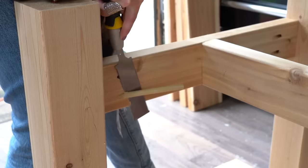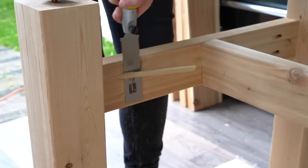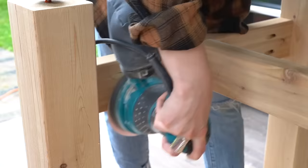Once those bumpers were installed, it was then time to close up all of those pocket hole openings. We decided to go a little fancy here and use some wood dowels and Dap's Weldwood Instant Wood Adhesive, which is really awesome because it sets up super fast — ready to cut down, sand, and stain really quickly, which is great for a one day buddy build. We also filled in whatever extra gaps were left over with Dap's Plastic Wood X, which goes on pink and then dries to a natural wood finish so you know when it's ready to sand. We continued this exact process for every little opening and pocket hole to give it cute little decorative accents.